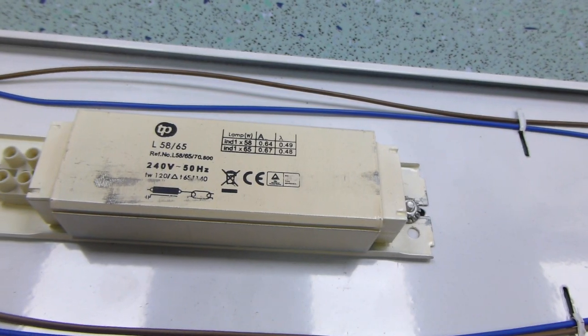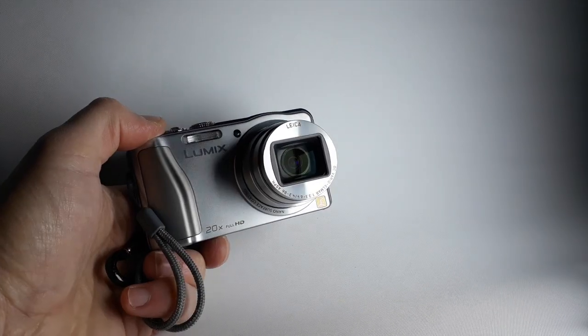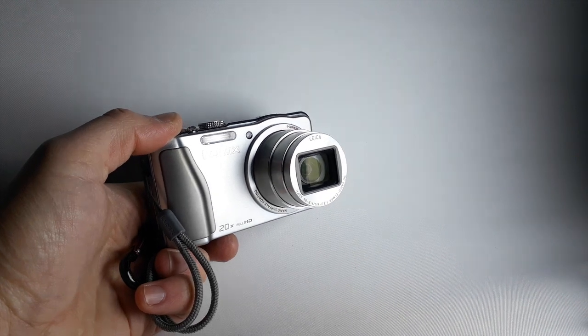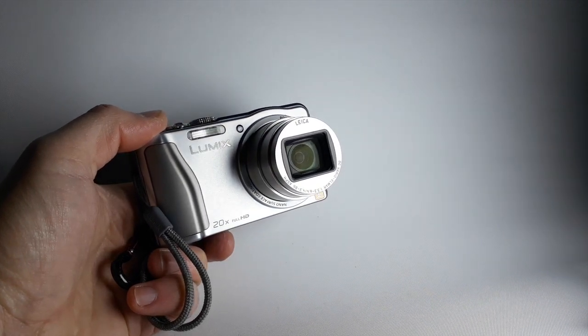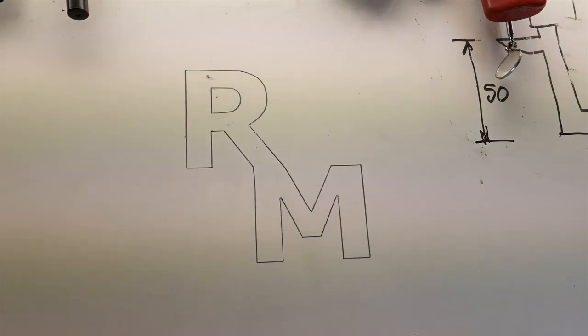The first is that it uses a low frequency magnetic ballast, which under certain conditions creates loads of flicker. I have a feeling that some cameras are able to phase lock to mains lighting to stop the hum bar running through, but my little Panasonic doesn't appear to do this, especially when there's a lot of motion in the frame. Here I've wildly exaggerated the problem by using my 60Hz phone camera with the 50Hz light, so you get the idea.